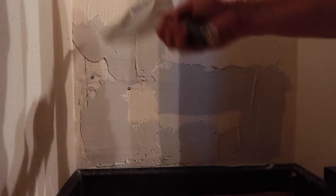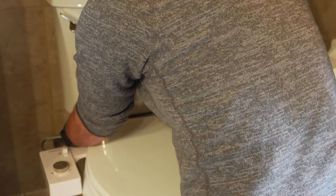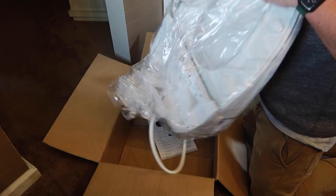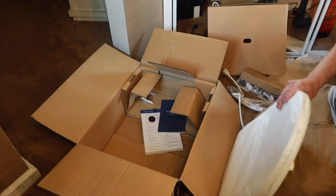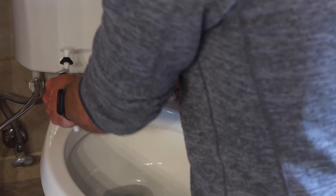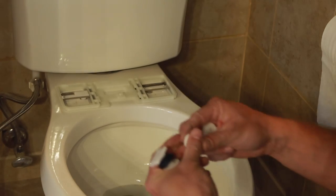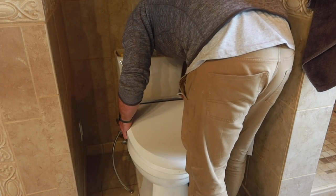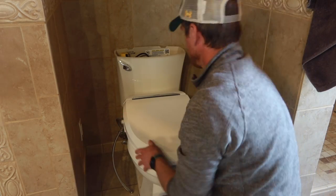Now that that's good, we can just focus on installing the actual bidet, which is the easy part. First, I'm going to turn the water off at the valve at the wall, flush the tank, drain as much water out of it as I can, and disconnect the water lines. I'm going to get rid of the old bidet setup, remove the toilet seat, and remove the bidet. The bidet comes in the box with everything you need: water hoses, a T-valve which goes onto the bottom of your fill valve on the toilet tank, the seat, and the mounting block. To mount the new bidet seat is actually pretty easy — you put on the block, drop in the threaded screws and screw it on just like a toilet seat, and then the actual bidet seat just slides in and snaps into place. Just make sure you pull the wire out of the way so you're not obstructing yourself.